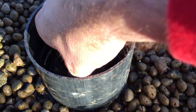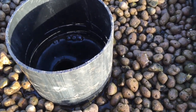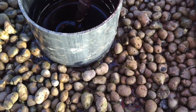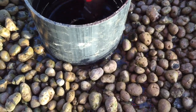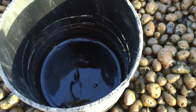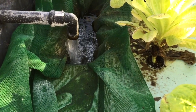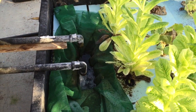Let's make an adjustment. The first thing I need to do is take off the cover to the auto siphon, and then just with a pair of pliers, go in there and actually pull the tube from the siphon out — just a bit of a wiggle. As that comes out, all that water is now going to start flooding through the drain. If we go down to the end you can see the siphon's kicked in and it's going to empty out into the canal, which is absolutely fine — that's what would happen normally when the auto siphon kicks in.